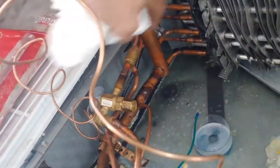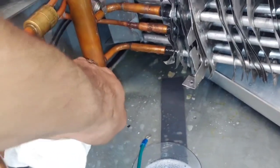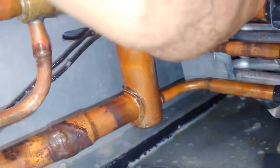I'm going to start by drying it off, then I'm going to sand it, then heat it up with my torches and put a bunch of 15% silver solder all the way around that joint - but especially that one joint there. I'm going to take off my defrost termination switch so it's not getting hot.